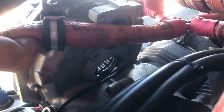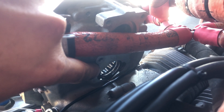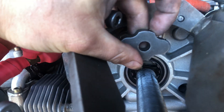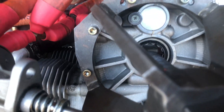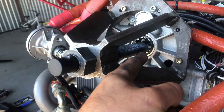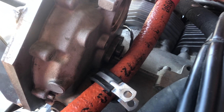If you take a look at the back of the gearbox housing, you can see it's not a perfect circle — there are two ears on the left and right side, put there for the tool used for extracting the bearing. Basically this goes on the back side of that bearing and is held in place by a large M10 bolt. Once installed, you hold this stationary and start spinning the nut, which pulls the bearing and the seal outwards from the case. Very easy to do.